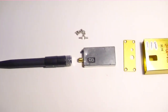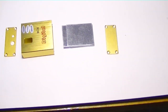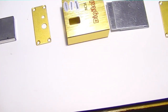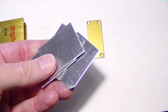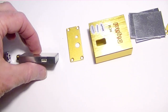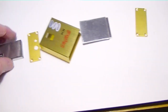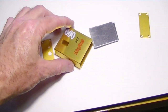Here's an exploded view of the video transmitter and all the pieces that were in the box. They had the transmitter inside the box with the display showing out through the hole, and then they had all these metal pieces stacked up underneath to act as a heat sink to transfer heat from the bottom of the transmitter to the case. And then they had all these screws to hold the two cover plates on.